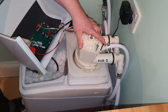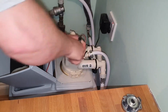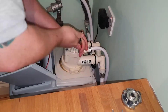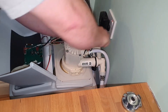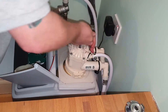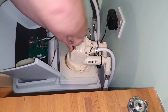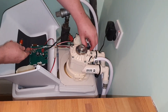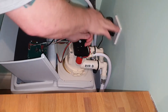Put the screws on. If you just turn the screw backwards a little bit, you'll feel it drop into the valve housing. Work your way around, popping the bolts down and lowering them gradually, taking them in turn so it sits on a level plane. Once you're happy that it's all down, flat, and really tight — again, I use it by hand because an electric ratchet could actually overpower it and damage the threads inside. Pop your cam back on. With your micro switch and cam cover with the motor, secure with the two bolts again.